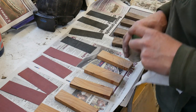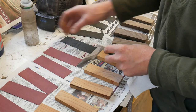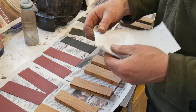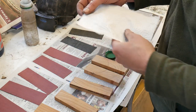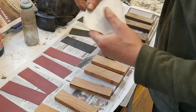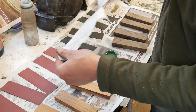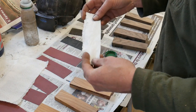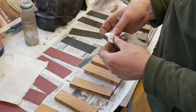Well that's the liners de-dusted. Now I've got to degrease them, and for that I use pure acetone. I get a piece of kitchen roll — if you tear it lengthways along where it joins the previous piece, it tears quite nicely and you get thin strips. So you don't need to use a lot of kitchen roll because it'll just absorb your acetone.